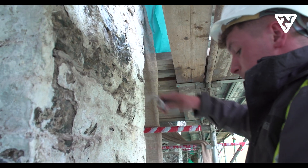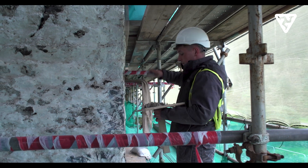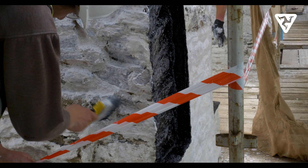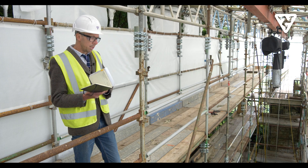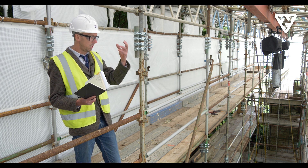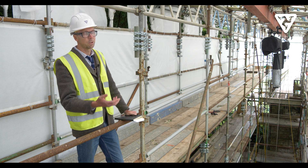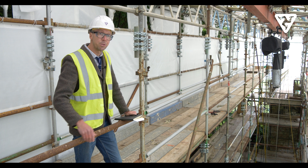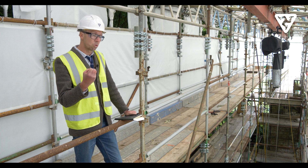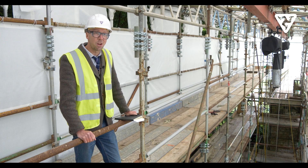While we've been doing all this, we've also been doing masonry repairs to the viaduct that goes down the valley — repointing, render repairs, and redecorating. That's been quite a process because this structure has no roof, it's constantly wetted, and the bogies have been oiled weekly since it was first made, so the structure was saturated with oil and grease. We've had to do a lot of trialing and sampling for the mortar and the paint — a lime-based wash made tougher by adding ground marble dust, which makes it much more durable. You could call it a shelter coat — a reinforced limewash.